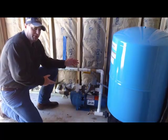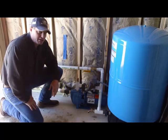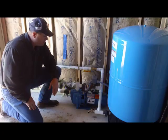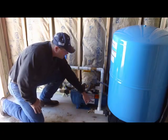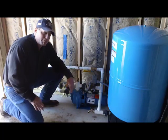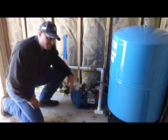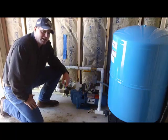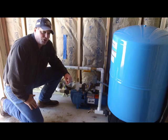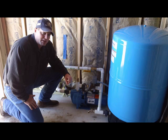If you have a booster pump that's outside and you don't have the benefit of a nice pump house, you need to get real serious about your freeze protection. There are some mistakes people make that you need to know about. This is an air-cooled motor — it sucks air in one end and pushes it out the other to keep it cool. The most common mistake is that people insulate the motor — this cylinder-shaped end here. If you insulate that motor, you'd better get your checkbook out and get ready to buy a new pump. It's going to burn it up — two, three months at the most. Every spring I sell about four or five booster pumps to people that have insulated it.